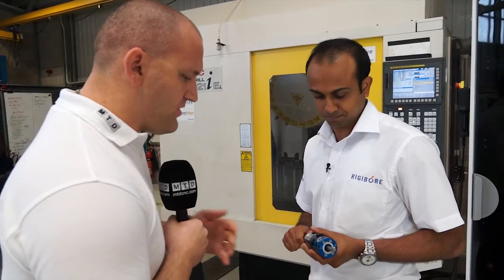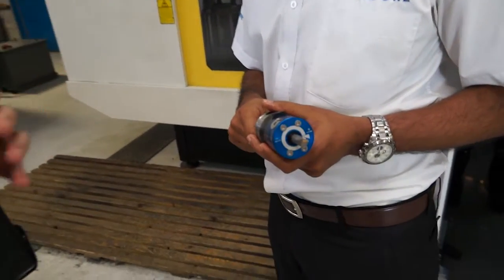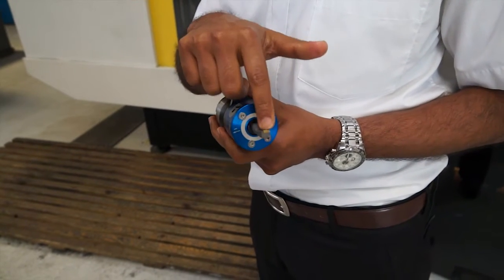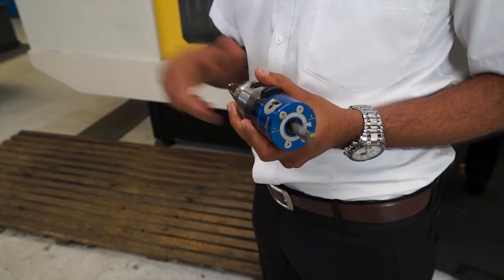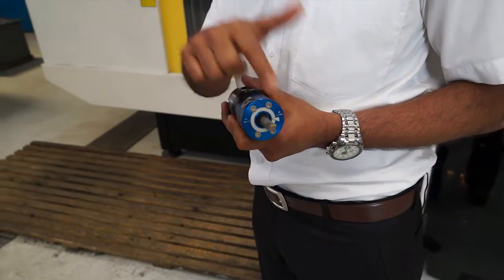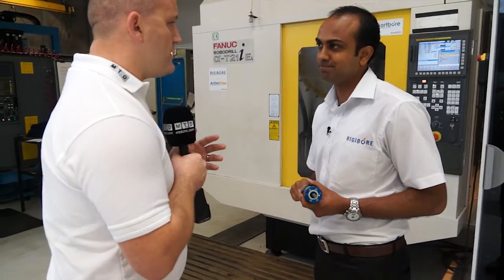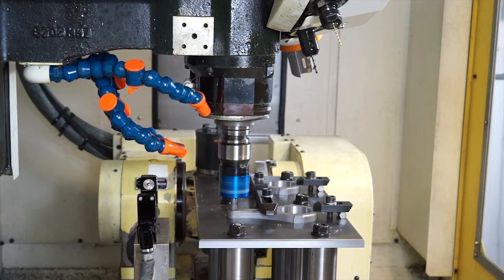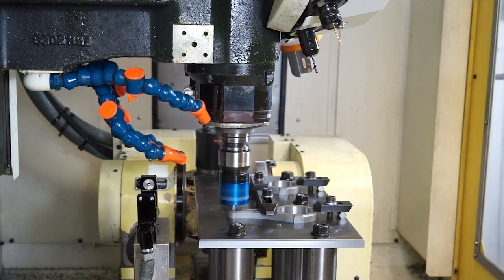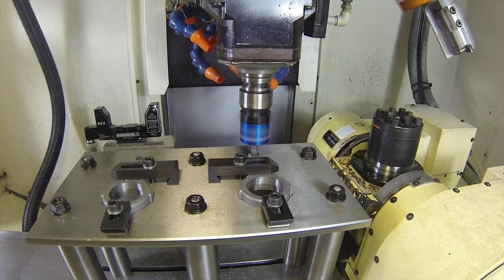What materials can it handle? You can see we've got a coated insert in there for steel. We can do aluminiums and super alloys as well. Because it's an indexable system, we have the option of changing the inserts to suit whatever material grade is being machined — aluminium, cast iron, steel, no problem. Change the ISO insert and you're good to go for any material. It's a complete ISO pocket, so you can use your regular inserts from your preferred tooling provider — swap them into this tool and you're ready to cut.